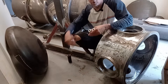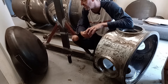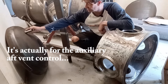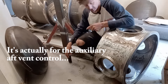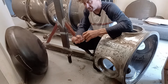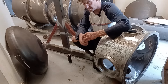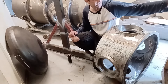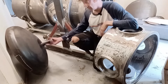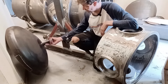I've made two more barrel penetrators. I need one for the aft main ballast tank vent control, which is going to go in the end cap. Another one is going to be for a rudder - I haven't decided if I'm going to have a rudder yet, but it'd be quite useful, particularly when towing. I also need to put in the inlet for the flood valve, which is going to go here at the back.